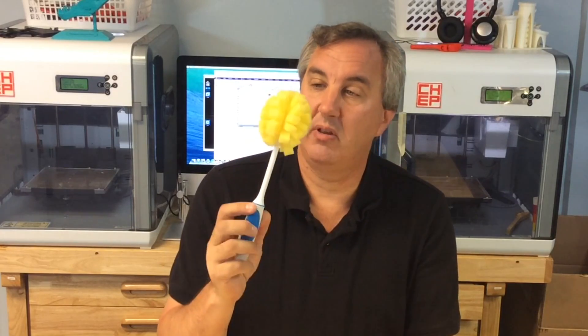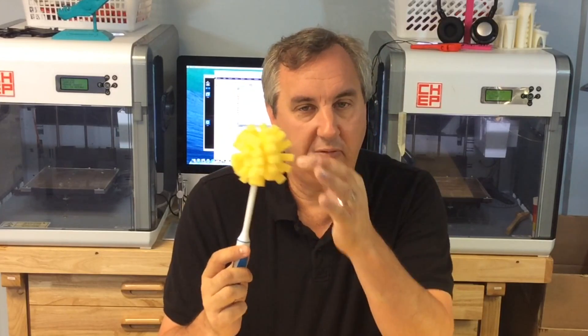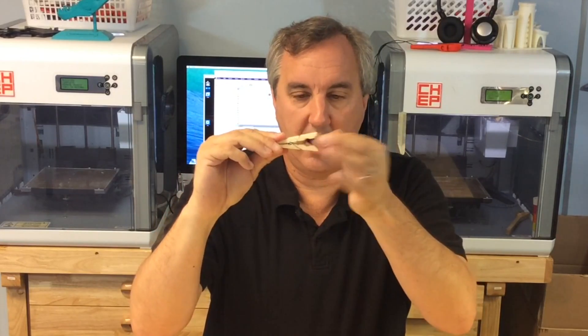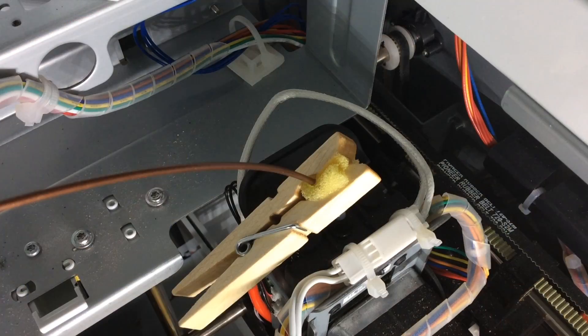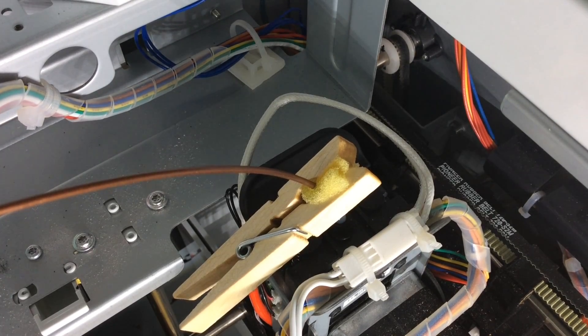What I did is I found a foam cleaning brush from my wife's kitchen and poked off one of the little sponges — she won't even miss it. I got a spring-loaded clothespin with a hole in the center, put the foam in there soaked in olive oil, pressed it down, and the filament slides right through it. Once she figured out what I was doing she let me take the olive oil, so I soaked the sponge and put it all together. It worked great — I never had another problem with the PLA. Here it is mounted around the filament just above the extruder, wiping it down before it entered the tube.